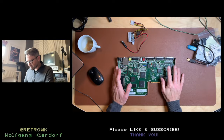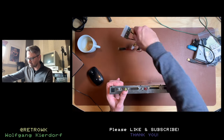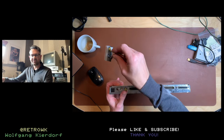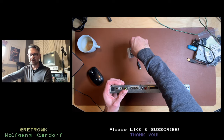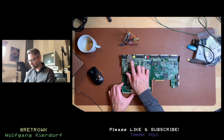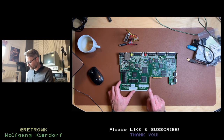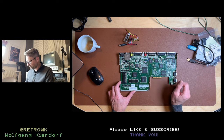Let's talk modifications. The first mod will be removing this power jack and soldering the minus 12, plus 12, and 5 volts from this Pico PSU. I'll remove this connector so it's nice and flat to go in the case, and solder the wires on the underside of the PCB. I'm not sure yet if I'll remove the RF modulator since I don't really need it. I'll also put a USB keyboard interface on here, which cost me 35 euros shipped.